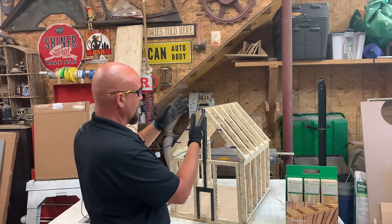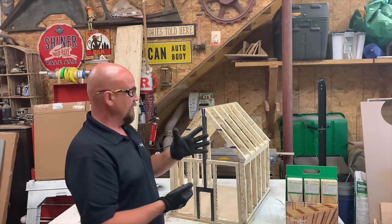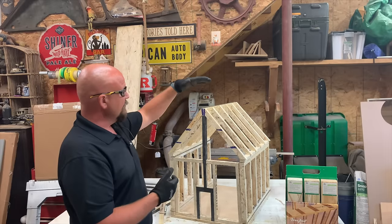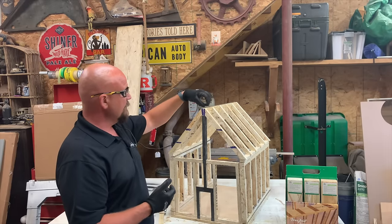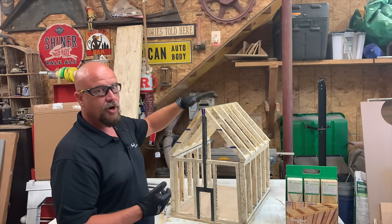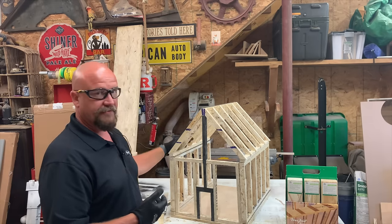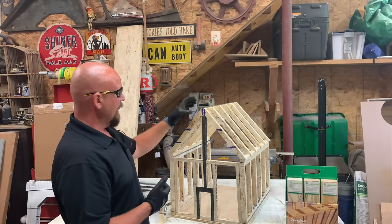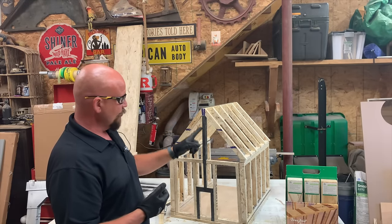For a single-ply, such as a five-and-a-quarter, you could go up to 18 inches in a parallam. The roof ridge as a beam is able to carry 50% of the load sitting on this roof — snow, dead load, live load — with 50% up at the ridge and the other 50% down at the walls. That load is transferred from the ridge down through a column.